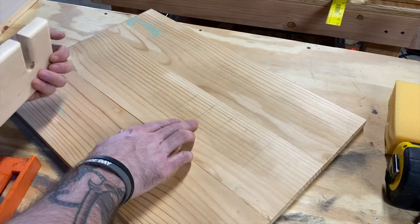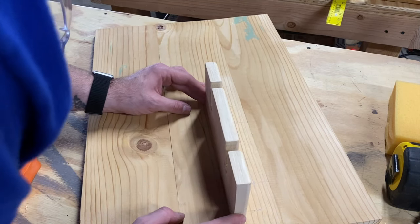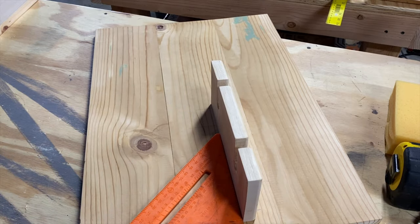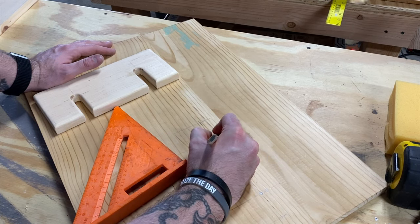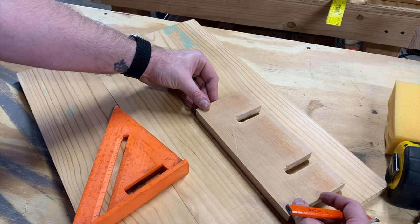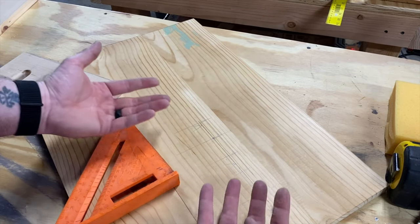Here's that piece, and these were the lines that I marked on there. Originally I was thinking about having it that high, but I think I'm actually going to pull it down a little bit lower. I'm going to use a speed square just to make sure I've got this thing straight and I'm going to mark it. Those are the spots where I have the shallowest depth, and I've got some meat on here to the left, right, and in the center. So I'm going to drill my holes in those three spots and attach it from the backside once I'm ready.